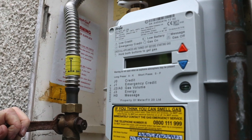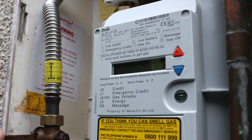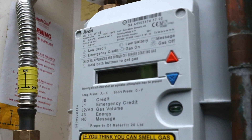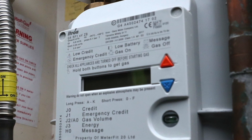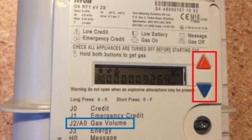We need to do our two-minute test. After 30 seconds the index will go blank, but the meter will still be measuring the flow during the test. After one minute and 30 seconds, press any of the orange or blue buttons again to re-awaken the display — this will show the updated meter index. Wait until the full two minutes (120 seconds) before taking the second reading. Take your first away from your second, times it by 30, times 38.7, divided by 3.6, divided by 1.11 — this gives your kilowatts net.